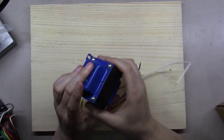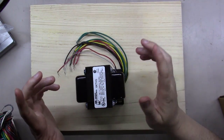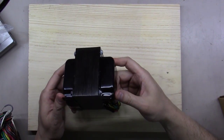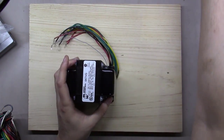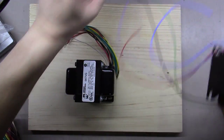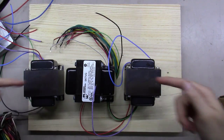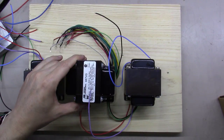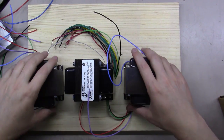The EdCore may be what you end up going with, or you could step up to others shown earlier in this series. This is the Hammond - bought through Allied - the 1608A, a pretty decent transformer. It would mount on top, and you'd likely orient it sideways, with the output transformers laid in one direction. That way the magnetic field from the output transformers goes one way and the magnetic field from the power transformer goes the other, giving you good magnetic field separation.